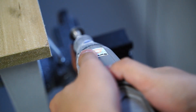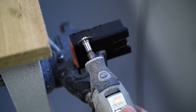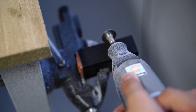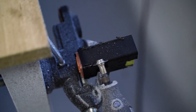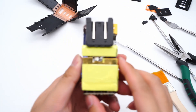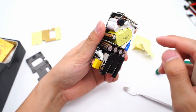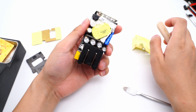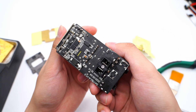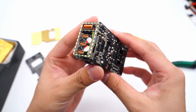Then let's tear it down. Remove the shell and take out the internal module. The AC pin is fixed together with the module. The back of the PCB is covered with a brass heatsink. The front of the PCB is bounded by a transformer. The input end is the rectifier and filtering circuit, and the output end is the secondary step-down circuit. Since the primary control circuit is independent, there are not too many chips on the backside, and there is a synchronous rectifier circuit on the secondary circuit.